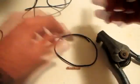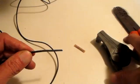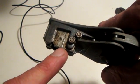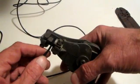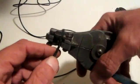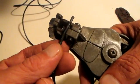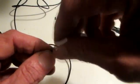We've identified our wire as 18 gauge. Take your stripper, identify which hole is designed for an 18 gauge wire, and strip it. Stripping a little more than a quarter of an inch off seems to always fit my splices and terminal ends just fine.